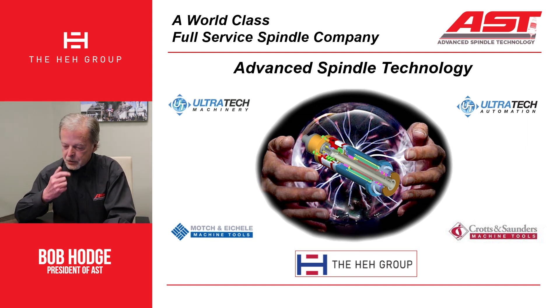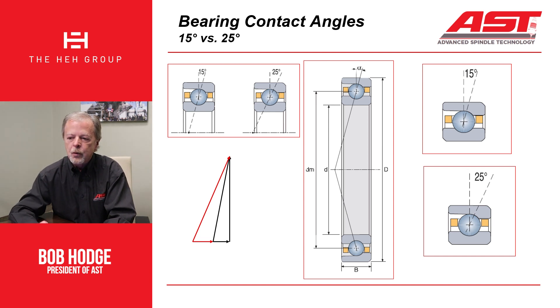What I'd like to do to begin is go through a little bit of a lesson on bearings. Spindles are the heart of the machine tool, but what people seem to miss sometimes is the bearings are the heart of the spindle. So we pay particular attention to the bearings. When we evaluate the architecture of the bearings within a spindle that we're repairing, we look for opportunities to make that spindle better than what it came out from the factory at, because factory-produced machine tools are meant for a lot of different applications, and what that really says is they really aren't optimized for any.